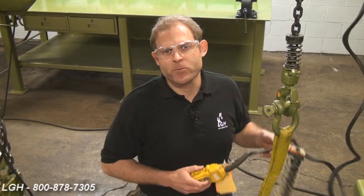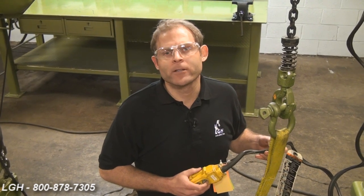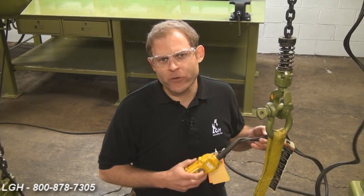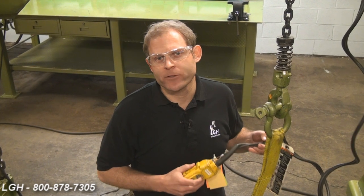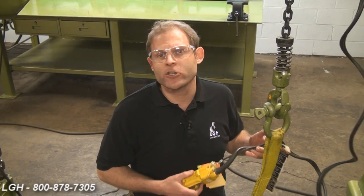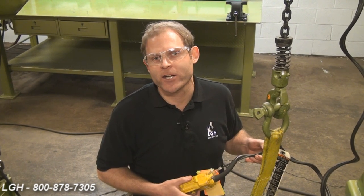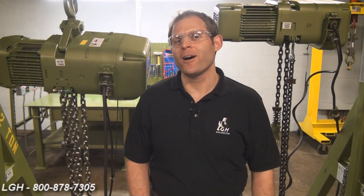You may also experience the hoist's inability to lift at the rated capacity, or improper lifting or lowering speeds. First, you need to check to make sure that whatever you're lifting is appropriate to the capacity of the hoist you're working with. Also, you may have experienced a loss or drop in voltage — either way, you're going to have to check and amend one or both. If your hoist is making a loud buzzing, humming sound, or is clicking, it may be trying to get more power. Again, you're going to have to check your connections and your cords.